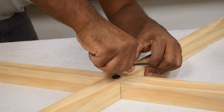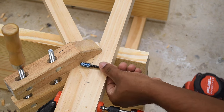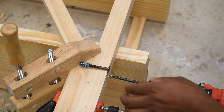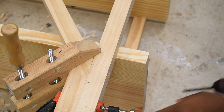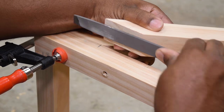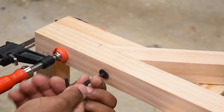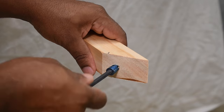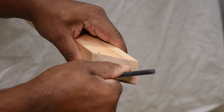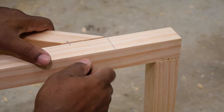This part looks pretty good, so let's address the four ends. Each end of the cross support will have a threaded insert going right into the end grain. I think this is good enough to hold the structure together since there's no load on it — it's just acting as a holding piece. If you have any concern, you can put wood glue down in the hole before inserting the threaded insert. If you don't get it in perfectly, you can always sand off the end so everything fits nicely. I modified a couple of the connecting bolts, and here's a closer look at how the threaded insert goes into the end grain. I repeated the same process for the remaining joints.